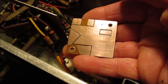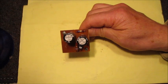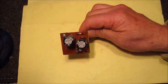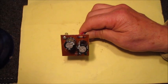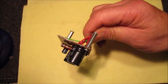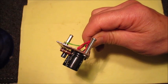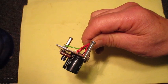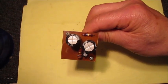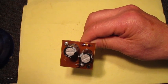It's now time for drilling and populating. Back once all of that is complete. It's certainly as rough as a bear's butt - nonetheless, I'm confident this arrangement will work just fine. The cathode resistor is set at about 2mm off the surface of this board; I want plenty of air to circulate around it since it will get warm. I positioned each component so there is lots of room - I don't want them getting too cosy and warming each other up.